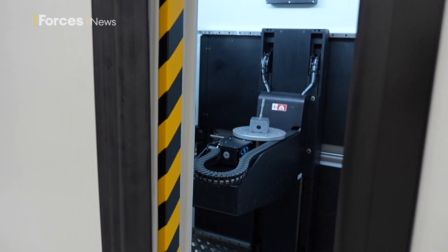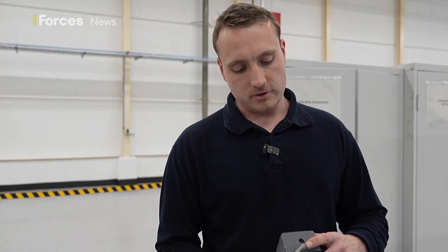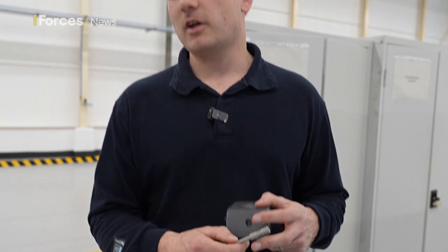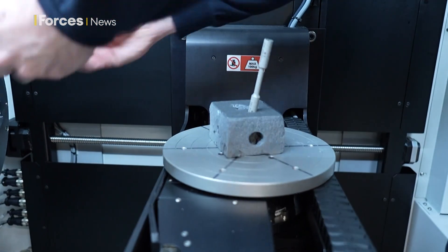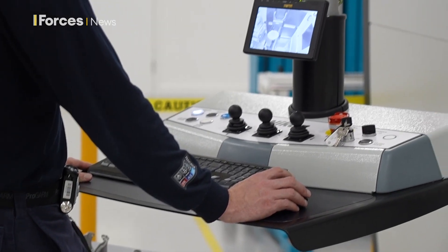Aside from model parts, let's see what it can do when testing newly made components that could be fitted to an aircraft. This is a dog bone, or test coupon, printed off one of the machines. This is basically to ensure that the powder's been laid up correctly. It'll be non-destructively tested in the XCT machine and destructively tested in a tensile pulling machine. That'll now do its thing — I think it's 20 minutes for that scan.